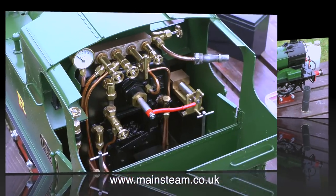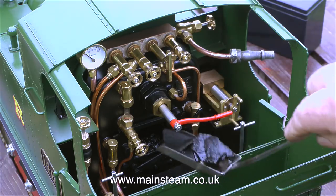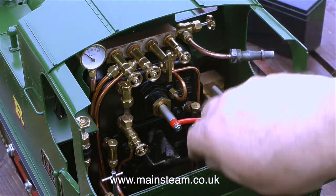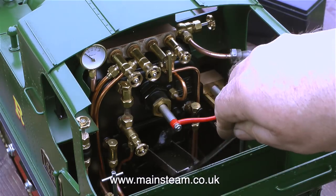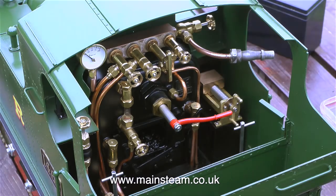This small locomotive has a proper superheater that goes all the way back through a tube in the boiler and into the fire, so the steam that hits the cylinders is very hot indeed, and I don't want to risk any carbonisation by mixing other oils in with the lubricant that would be normally used, which is 1000 grade steam cylinder oil.